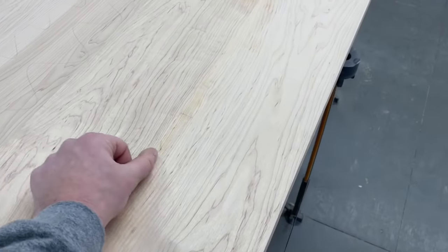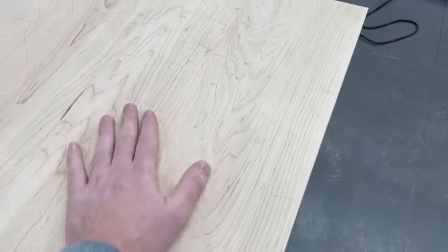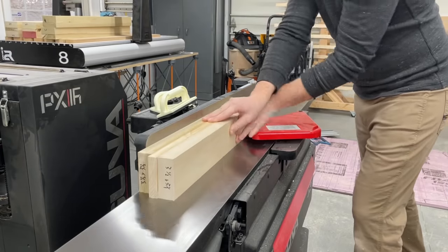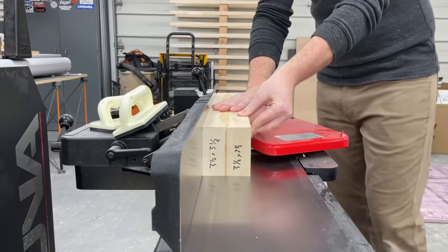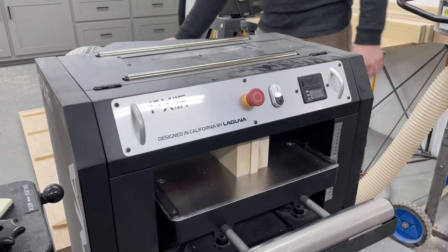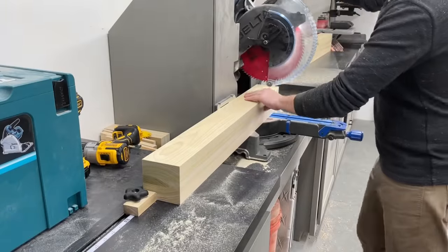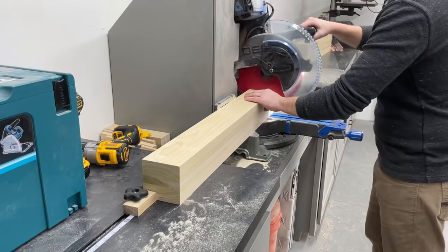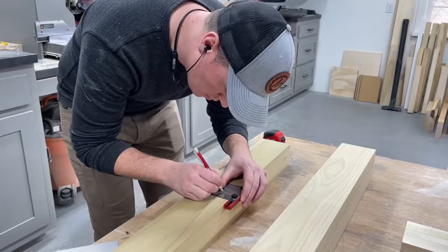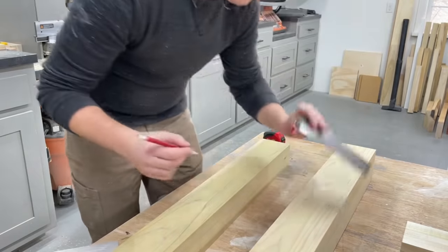And when I say these turned out perfect, I mean they were absolutely perfectly flush. I left all the base pieces oversized to start and now I could go ahead and run them back through the milling process to square them up and plane them down to their final size. If you have any questions on exactly what these machines are doing here I have a more in-depth video going over the process on my channel if you want to check it out. With everything cut to final size I could start laying out all the joinery, which is just a mix of half inch dowels and screws.